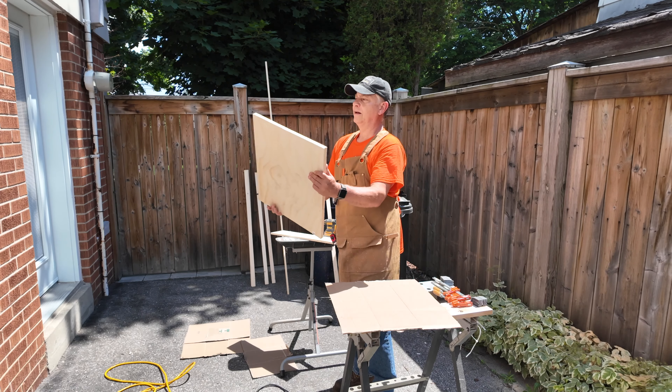With that part of the project done, I'm going to grab a simple piece of trim — I believe this was a five-eighths inch piece — because I just wanted to frame up the edges to hide the plywood and clean it up and make it look a little prettier. This was just a simple job of measuring out my four sides, cutting 45s again, then gluing and nailing that frame in place around the piece. And there you have it.